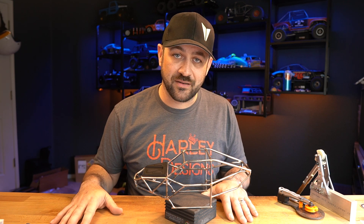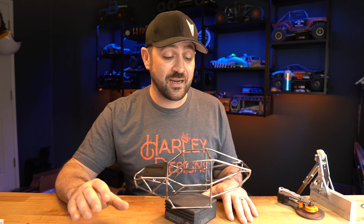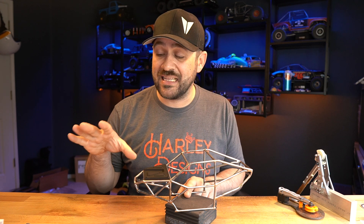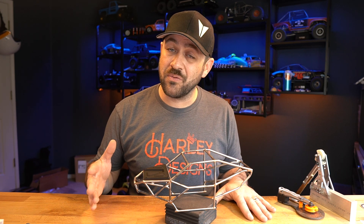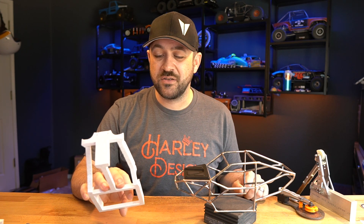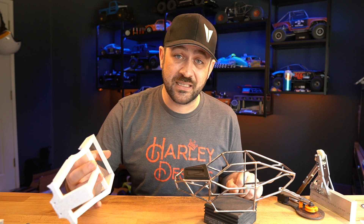Ideally to do this the way I've designed it, you're going to be using a TIG welder. TIG welders can be had for $200–$300 these days and that will probably get the job done — I started with a very inexpensive one. Mine now was about $750, but you can spend as much as a used car if you really wanted. If you have some sort of wire feed welder, you could likely tack it into place in the jigs, then remove it and braze it — that would probably also get decent results. I don't normally like MIG-welded chassis, but it's a way you could get through it and still get a pretty clean result if you clean up those welds. You'll also need a 3D printer — most should be capable. All the jigs I'm printing here are standard PLA, run-of-the-mill Hatch Box PLA.